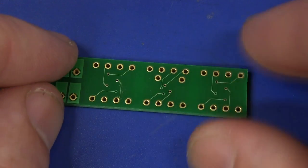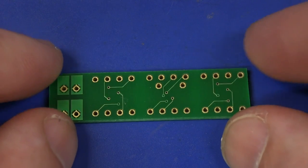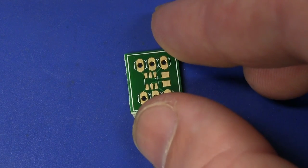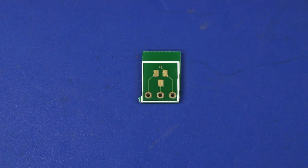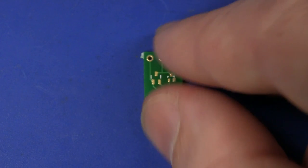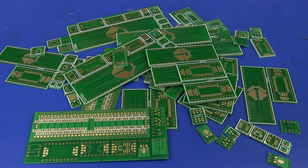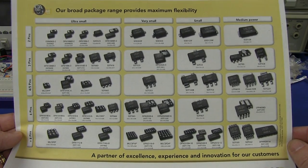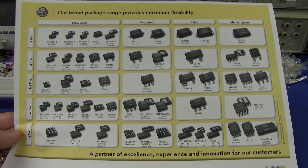On the back here we've got another package that looks like a SOT-89 or something like that, and we've got a SOT-223 here - one of my favorite little packages. But once again, pretty wimpy traces. They've got the nice heatsink going around here but a little wimpy 10-thou trace going down in there. And we have a couple of little SO-8 adapters, plus what looks like a 0.5mm pin pitch. I think Moritz is into AVRs, because here's a little AVR Tiny 10 adapter, complete with a little bypass cap on there. And what looks like a harmless SOT-23 adapter is also a SOT-323 and SOT-416 adapter as well for those tiny packages. So thank you very much Moritz, that is a huge score. And here's a nice little NXP cheat sheet for all different types of packages - I'll provide a link down in the description. It's well worth laminating and sticking up on your wall.